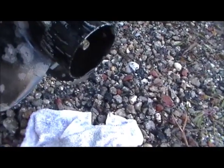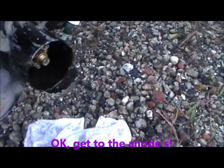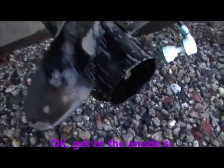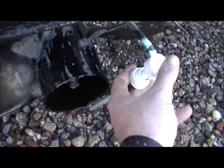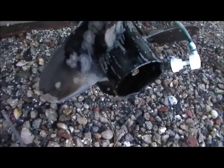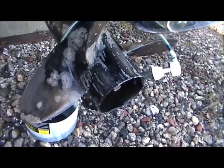This is the last section we need to work on to get the boat fully winterized. This here is the gear lube pump. I typically just hang it over the prop like that to let it drain out and give it a little squirt here and there. Don't do it like I did on the dirt and mess up the environment — that wasn't too smart. I'll do it the right way and put it in properly.